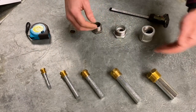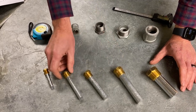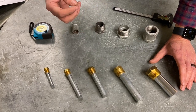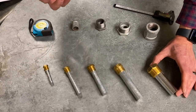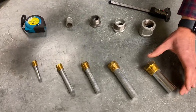We also do larger ones, and we do many different lengths of the zinc that's coming out. These are usually used in salt water, brackish water — hot or cold, under pressure — so tanks, pipelines and ships, water heaters, and certain applications where you would have a corrosion problem with some sort of salty water.